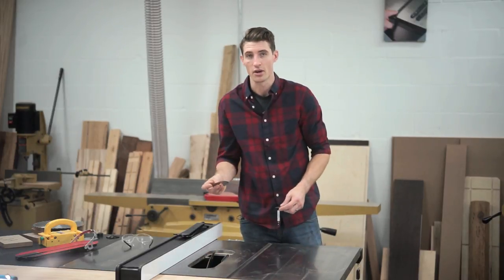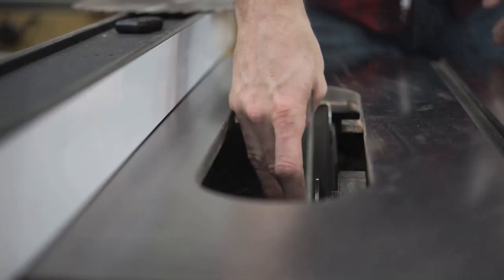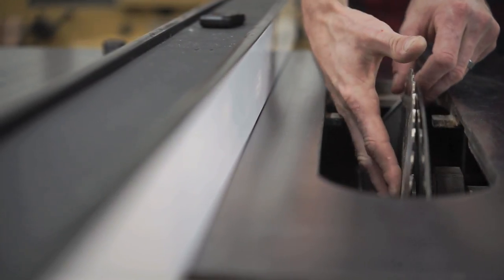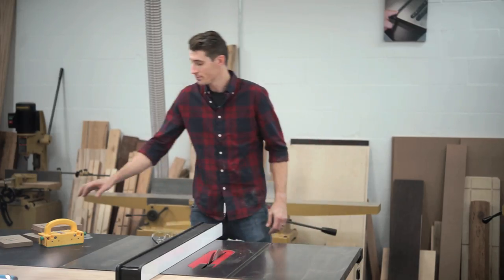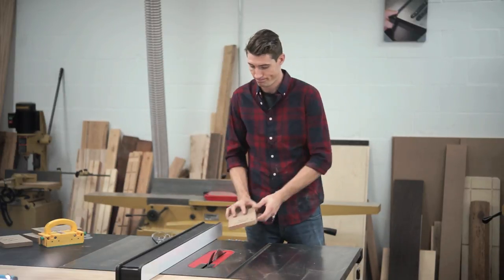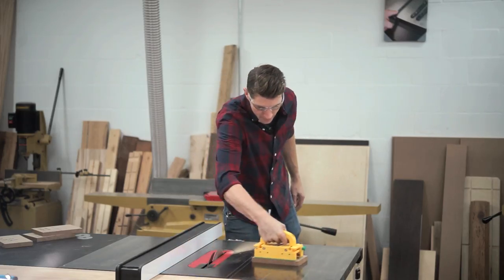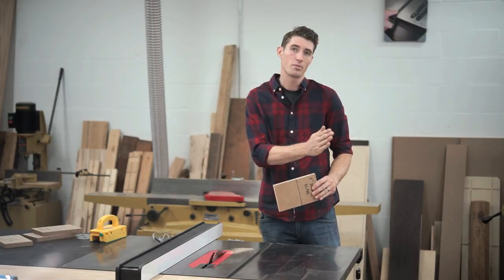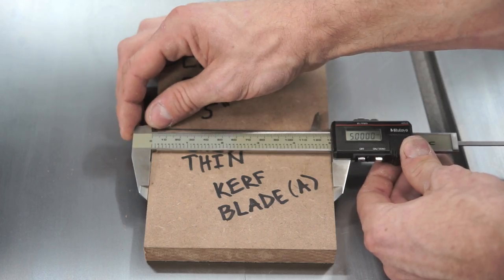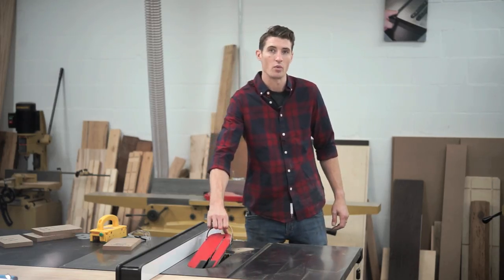When you install these shims, they go on before the blade. You start with the thinnest on the inside and move to the thickest on the outside. Remember when you reinstall your blade, you need to make sure that those dots line up so that your blade's in the correct orientation. Arbor shims are installed — let's cut that board again to see the zero cut line match up. Success! By putting the arbor shims on the backside of the blade, that brought my blade out to the zero cut line.